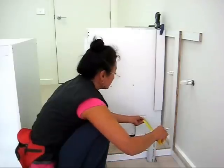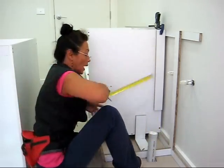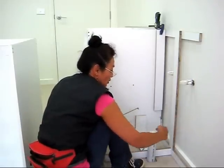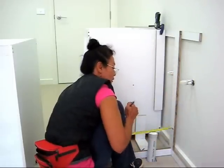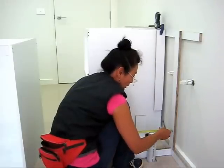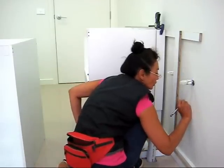And I'll measure again — always measure twice and just cut once. So now on this wall I have to get the distance of the cabinet, my wall, to the drain. I've got an arrow there. So I just put another piece of well-cut timber here, which is 16mm, which is my panels for my cabinet. And I'm taking 148mm.